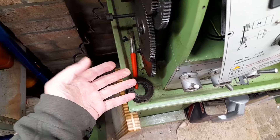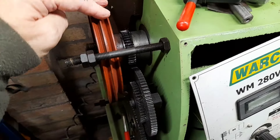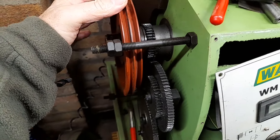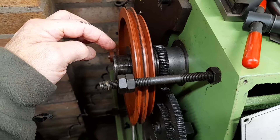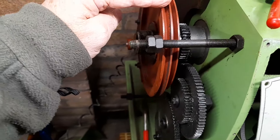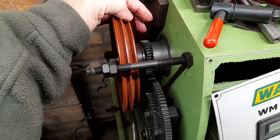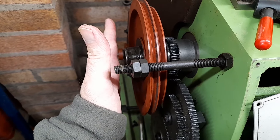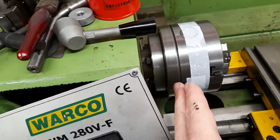I haven't cleaned it up yet, but this collar won't move. When I couldn't tighten it up before, it was probably because it's seized on the shaft — and I certainly can't move it now, so that's more or less guaranteed. I've put some releasing fluid on it and left it overnight. I'm going to try driving something sharp down there — I don't want to pull on the outside in case I shatter it. I've tried a piece of wood and a hammer, and a large copper hammer, but nothing happened.